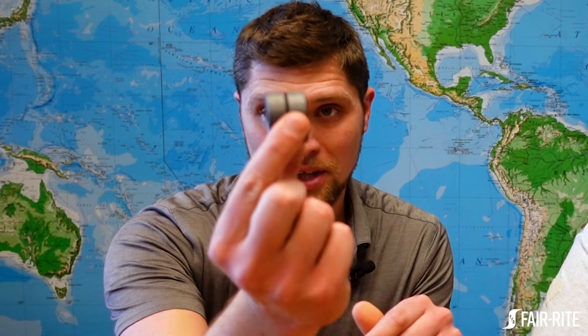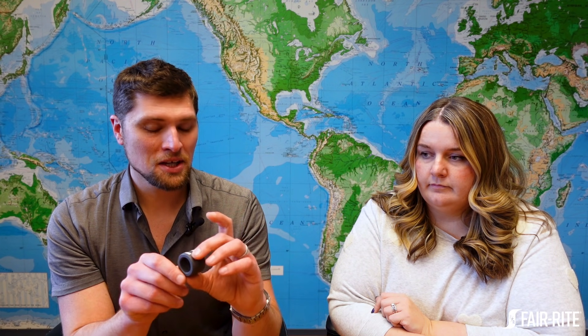If you took two toroids, for example, you could just make that as one solid core and it would perform largely the same. The main difference comes when you're working at really high frequencies. If you make — call it a compound core — made of multiple smaller cores, and treat this like it was one piece and wind around both of them at the same time, the advantage versus a singular large core is in dimensional resonance. You're not going to have the same propensity to create standing waves at certain frequencies with two smaller cores than you would with one larger one.